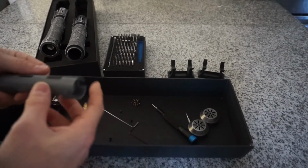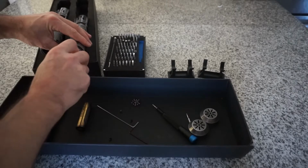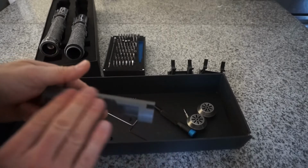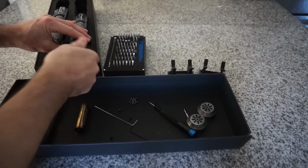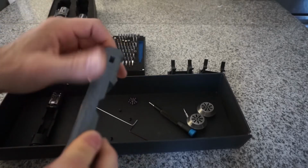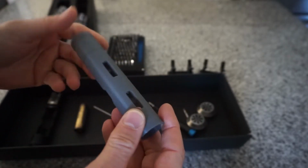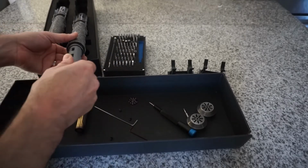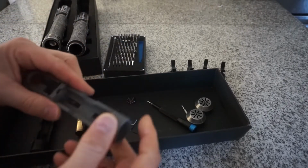I'll Scotch-Brite it because, as you can see, the first time you put it in, you're going to hear it rub. If what I did with the Scotch-Brite doesn't even out and make it smooth, then I do this. I just go in and out to rough it up a little bit, and it breaks down the high points. But you'll see because of that elephant's foot, it'll go in, but it's really snug. So that's why I drum wheel that.